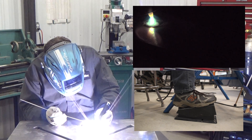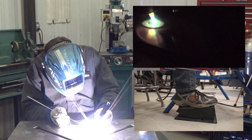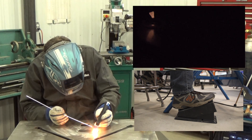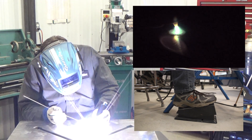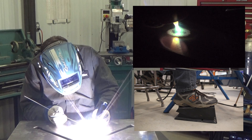I'm going to add more and more power — and there's that puddle starting right there. That's where I'm going to hold the foot control. Once that puddle starts, that's your indication when you can start adding filler metal. More power, and there's that shiny spot.